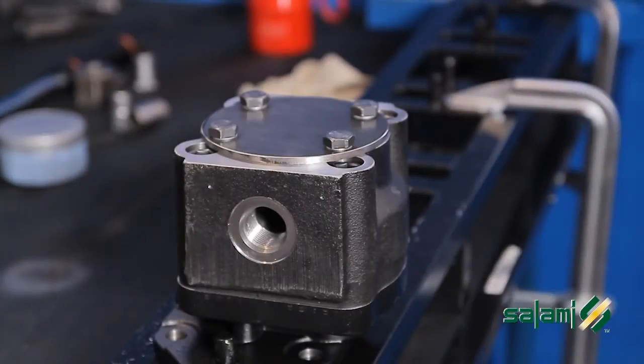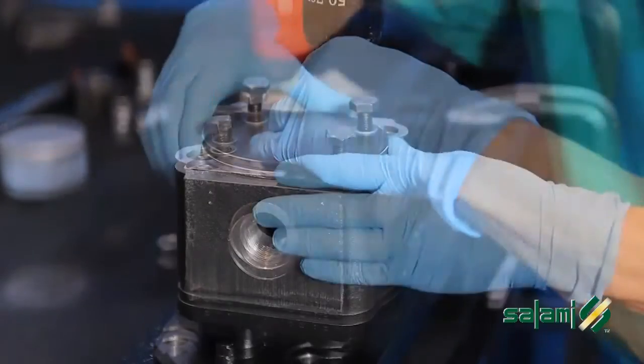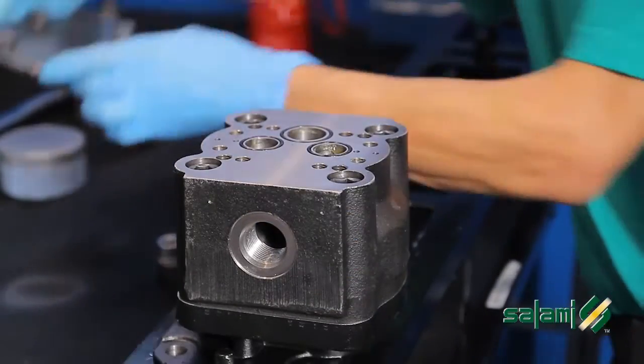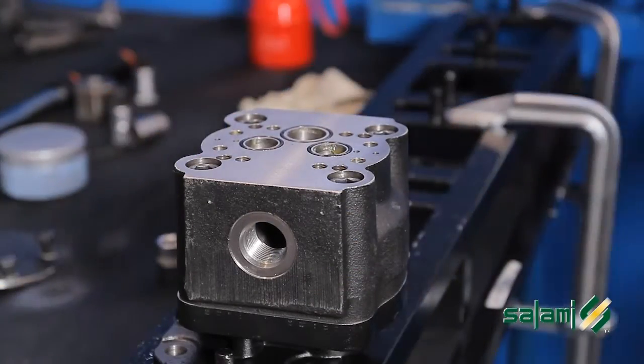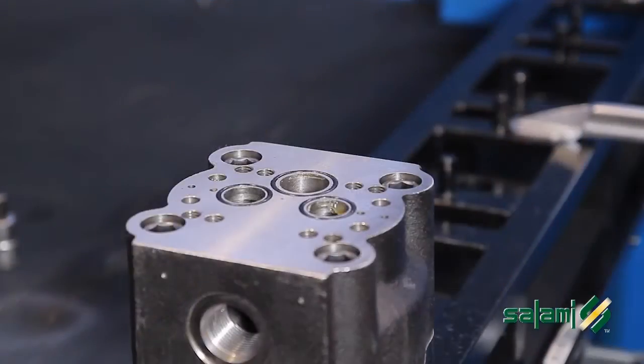Start from the front pump, locking it in the upright position. Remove the back cover by unscrewing the four screws M10. Before proceeding, check what is the suction side of the PG331. It is easy to recognize — both common suction holes are always larger than the outlet.